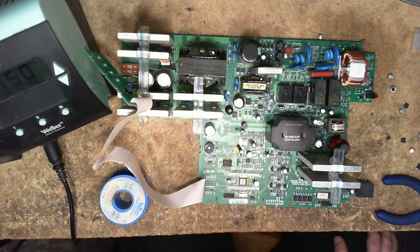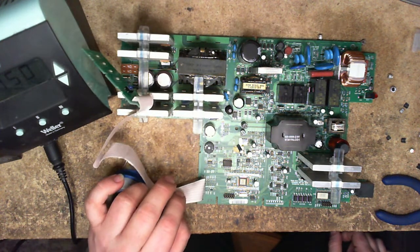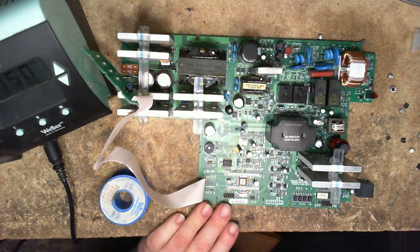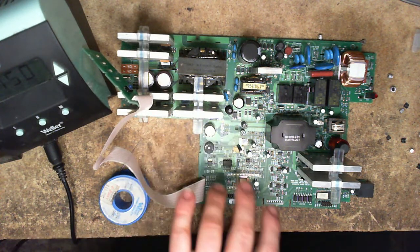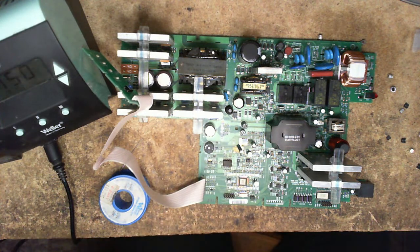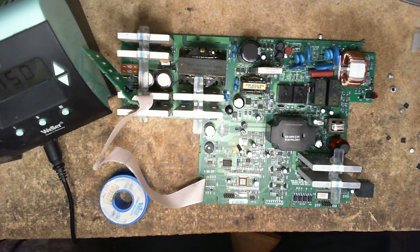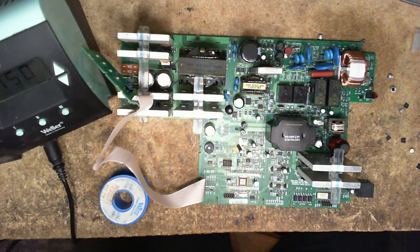They keep thinking, oh, there's no AC power, let me run on battery until I die, then I'll use AC power to charge up again. Immediately followed by turning it back on and it's saying, oh, there's no AC power, let me go back on battery. My guess is that with all of these being a dud, for some reason the AC line voltage sense is just not working. Or it could be quite simply an optocoupler has failed. And I don't know. This is a complete test. If this doesn't work, I'll just grab another UPS.